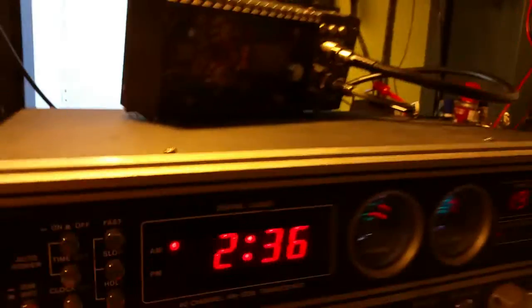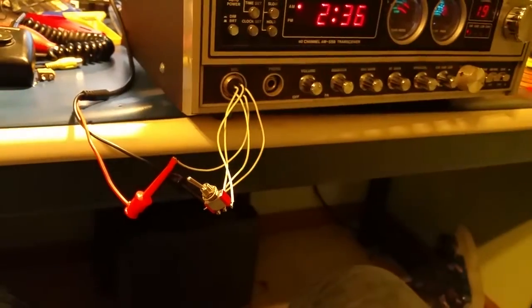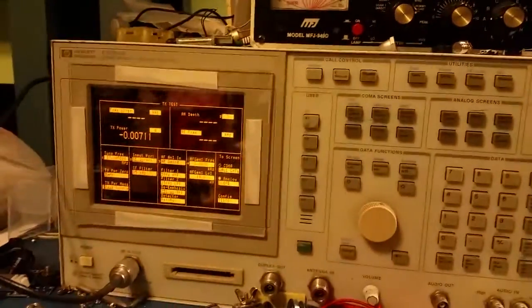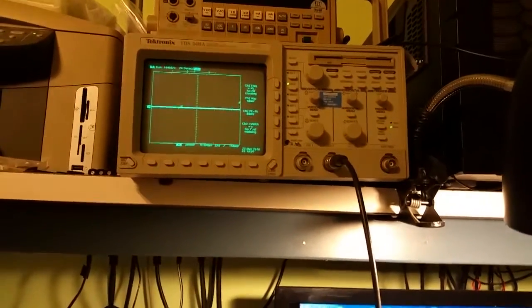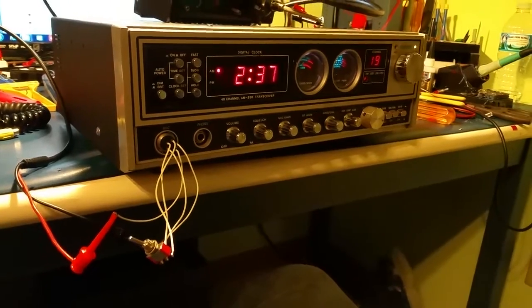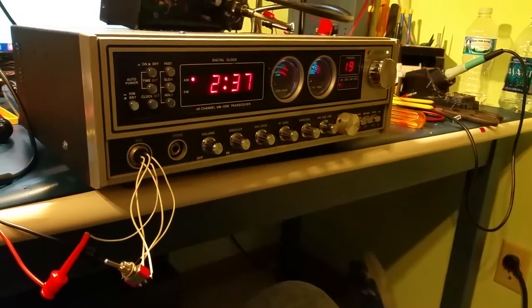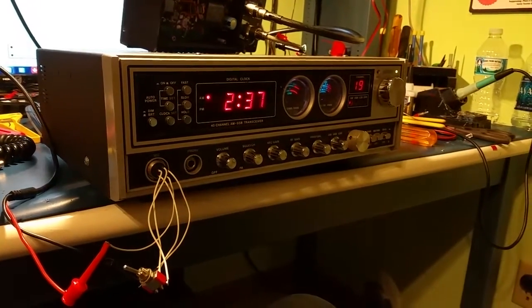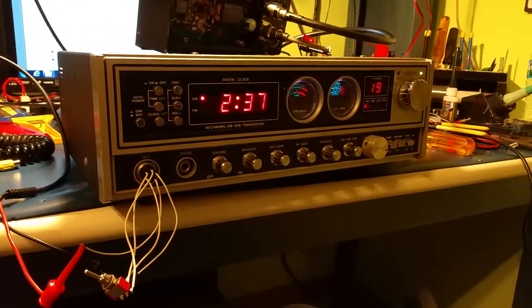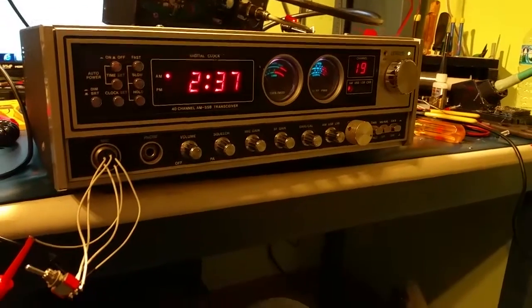The test setup is a little test harness that hooks into the audio jack on the communications monitor here, and we also have sampling of the signal that feeds into the oscilloscope. We'll start by showing you some settings — how the radio should be set up. Some of you may not know this, but we'll show you what a properly set up radio should look like and the effect that having modulation too high or not driving an amplifier can have on the power reading.